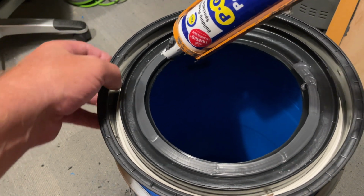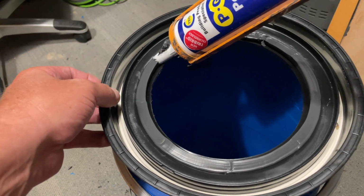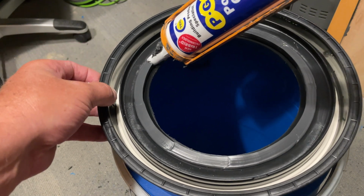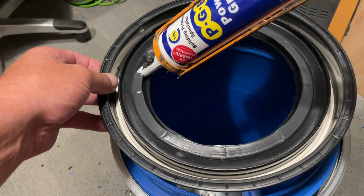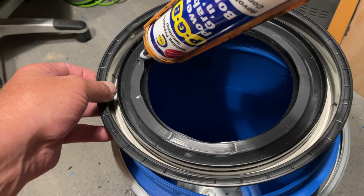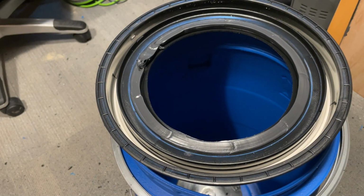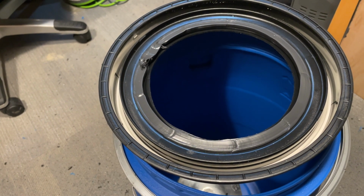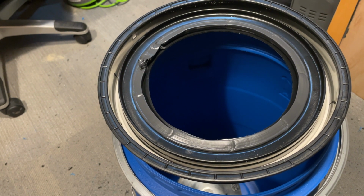And literally the static filter build up to this point is almost identical, with the exception of course, the airline. I didn't put an airline in. I can back flush it through the pump, past the bottom drain, through a T to waste. So it doesn't really need an airline to stir it up. I can get my old mitts in there and do it with my hand. Not opposed to doing that myself.